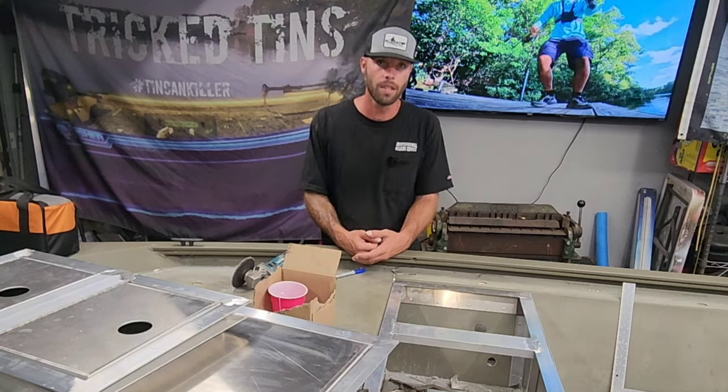Then we have the rear bench kit. This one was pretty simple. The way this one was made, it didn't have this gap up in here. Some of the older trackers had like a 2-inch gap right here, so we didn't have to worry about that. And these pieces I made here were actually bigger. These were 24.5. So I'm probably going to have to up the size of these little pieces right here for the fillers to 24.5 inches.